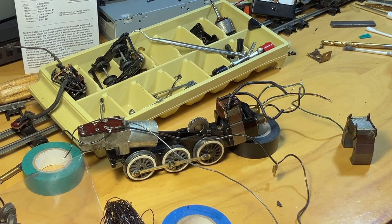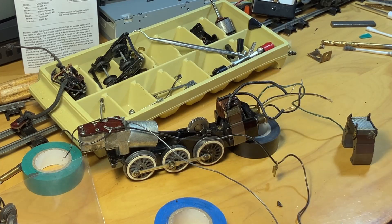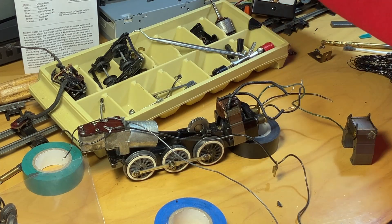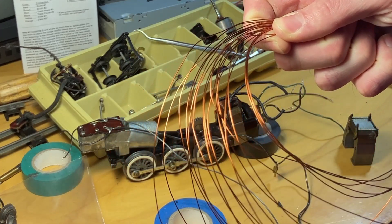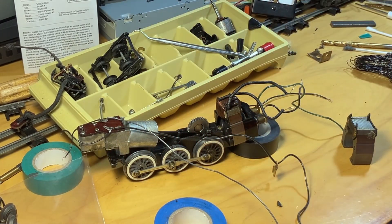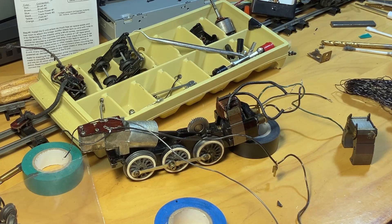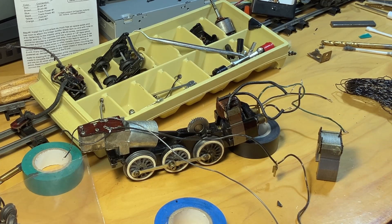It's from the mid 50s where enameled wire during the Korean War was not readily available, and whatever this coating is has failed after 70-something years. This is the new wire that I have - brand new enamel coated wire. You can just get it off Amazon. It should be the exact same wire gauge and I'm going to be rewrapping this field coil for the large motor.